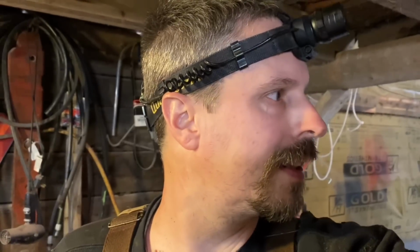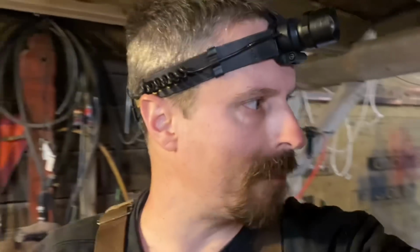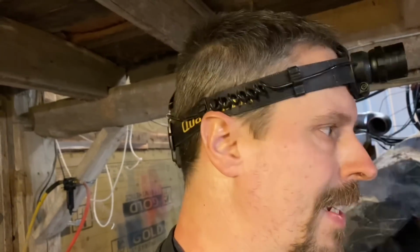Now, guys, you know, when you reinvent the wheel, it takes a minute. So I spent the last 45 minutes under that tractor pulling that big hose back and forth from this side to that side, and maybe this will work. I finally got it. Everything is routed along on the right side of that tractor if you're sitting in the seat, just the same way that all the rest of the hoses are. So I just got to get that fitting on my filter loose, get it pointed in a good direction, so I ain't got to make that hose do a 180-degree turn to get back on it. And this is going to be ready to go.